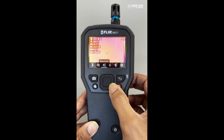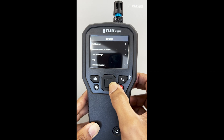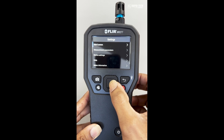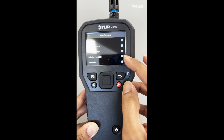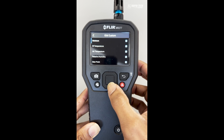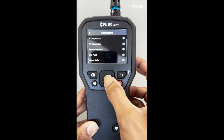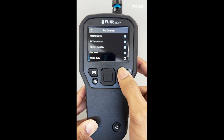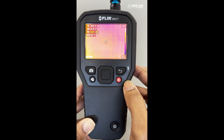To configure the custom measurement, enter the menu, move across to settings, press enter, and you will see the first option: IGM custom. Press enter and you can select what to show in that window. All items are ticked by default. For example, if you don't want to show moisture or mixing ratio, you can press enter to untick them. Pressing back will apply the changes and the custom measurement display will update accordingly.